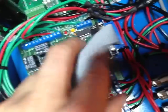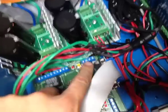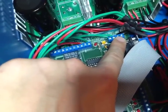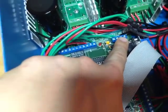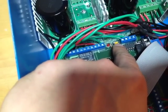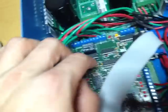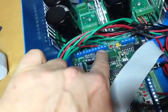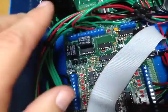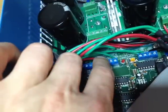Here's the input — another ribbon cable, which was fun. I had it backwards a number of times until I finally figured it out. Here's the 12 volt input — this is if you want to control something like a speed controller or VFD. Once you put 12 volts in, you can adjust this potentiometer which controls the output from zero to 10 volts, giving you a nice little speed controller.